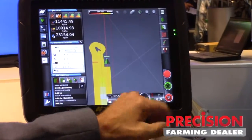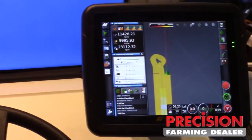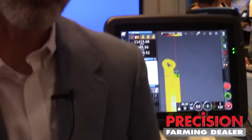The system is very accurate because it's a volumetric system — it's actually measuring the amount of grain that is carried by each paddle or bucket on the clean grain elevator, and we count each one of those.